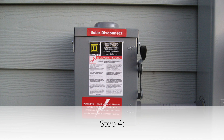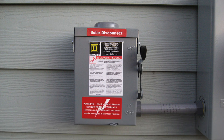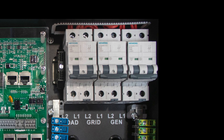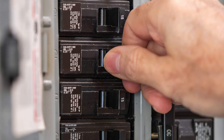Step 4: Apply DC and AC power to the inverter. Turn all relevant DC and AC disconnects on. When first commissioning the system, leave the Solark's load output breaker off and all circuits in the main house breaker panel off. If the Solark is programmed to a mode of operation in which the batteries discharge to the main house breaker panel, refer to section 5.3 of the installation manual for more information on the Solark's modes.